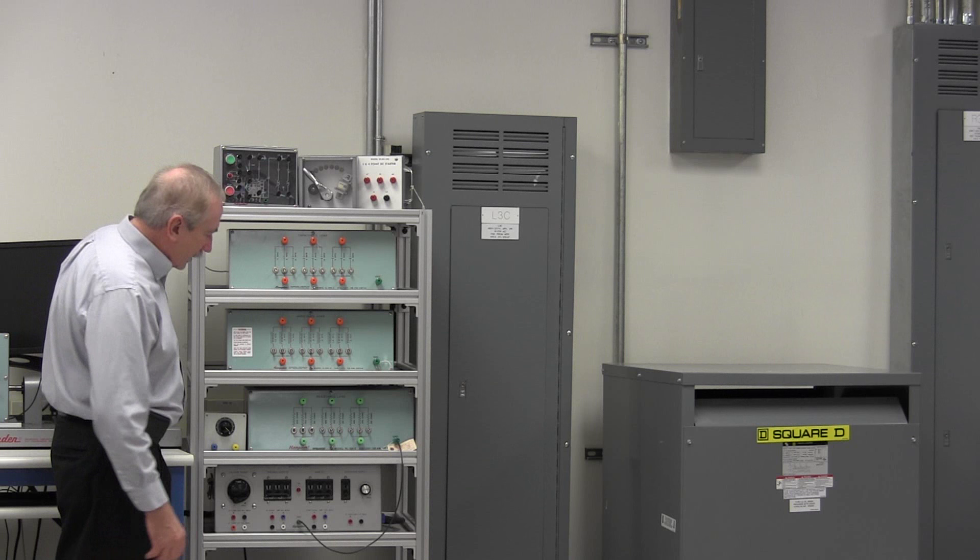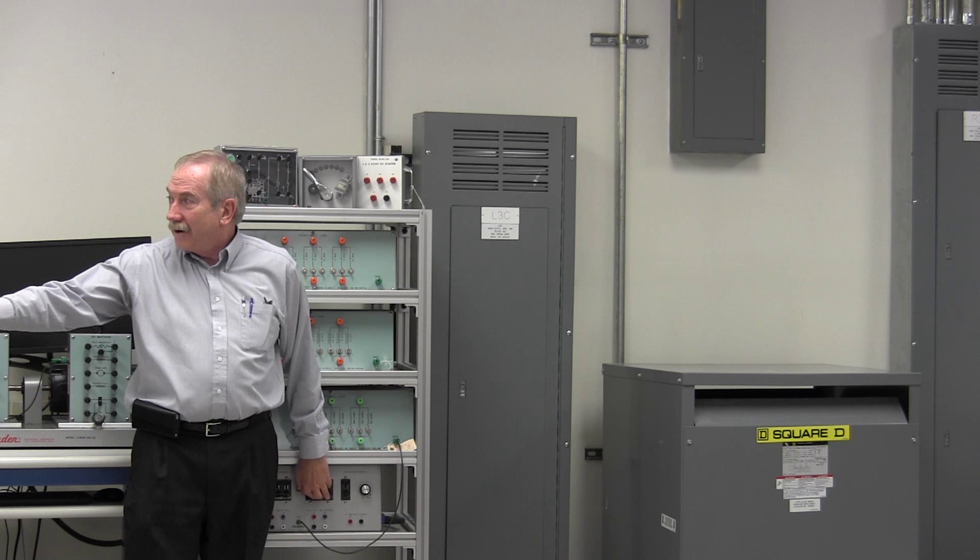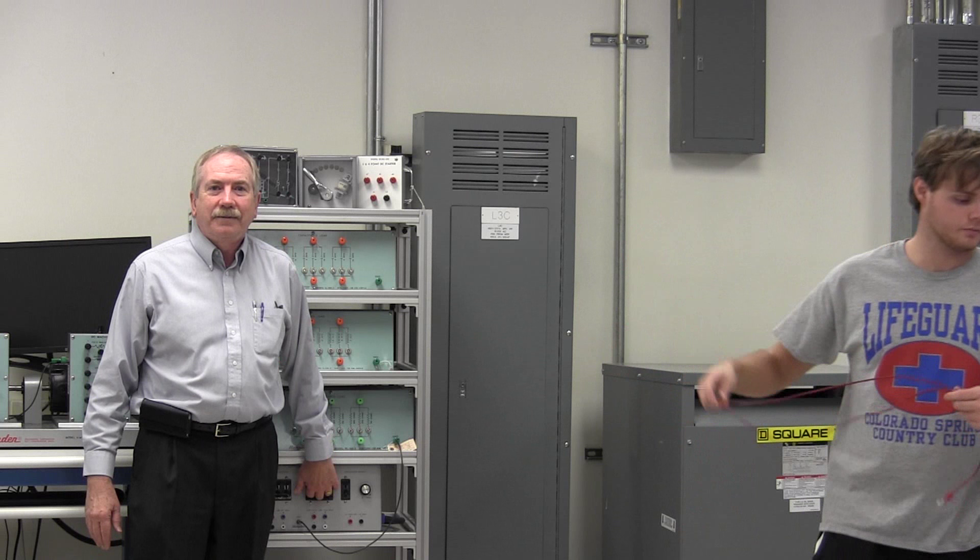What we teach you to do is stand with your back facing the board, so one hand is free and not touching anything, the other hand touching the breaker, and you turn the breaker on. When you turn it off, you do it the same way.